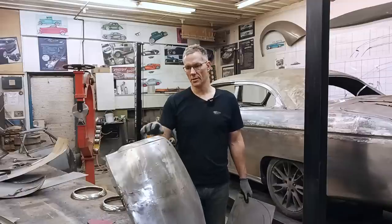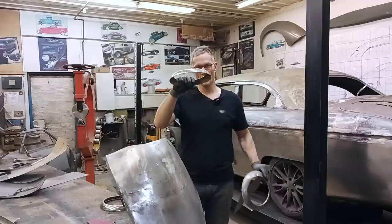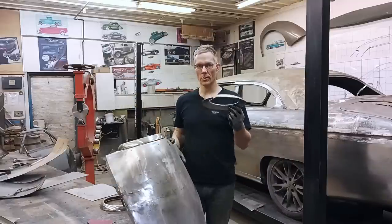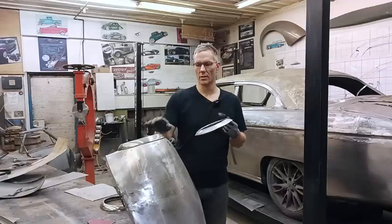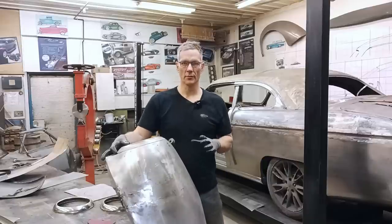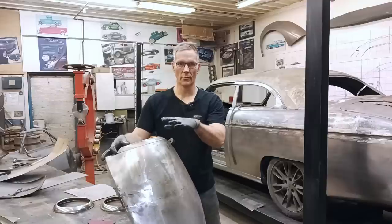Now with these rings, I kind of made them a little more subtle. These have a more pronounced kind of protruding effect, and subtlety is key. So see how high they are? With these new rings, I stopped forming them when I was happy with this height. So they're about 2/3 of the height of this one. And they're gonna flow in with the fender a lot better. See that? I have to do a few more things to these fenders, finish them up, get them mounted on the car where it'll be easier to blend and work these headlight rings into the fenders.